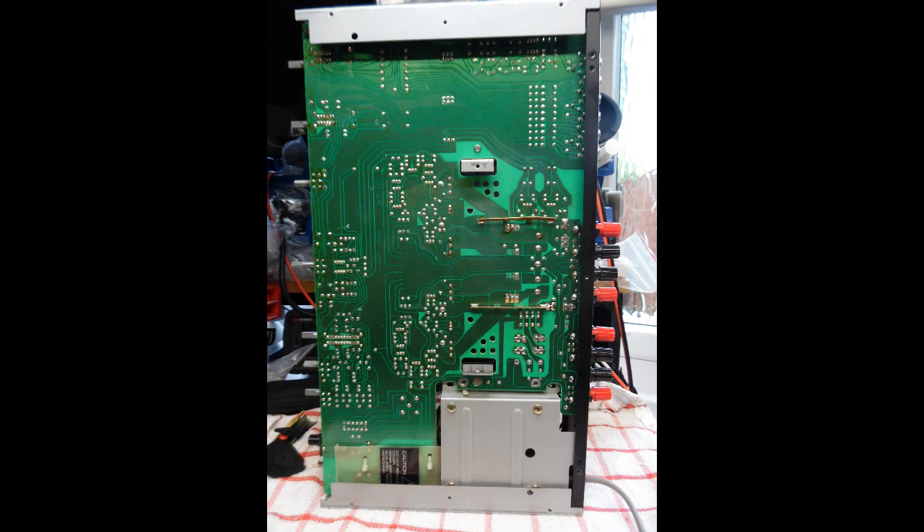This will clear the switches and give good durability. The final part of the repair and restore, as is commonly the case with all other amplifiers, was to check the solder connections across the board. There were a few suspect joints on the speaker terminals where they had started to break away slightly, so all of those were reflowed.